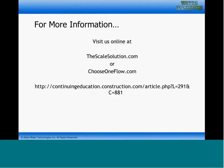So what we do in those applications where you have fresh copper on the feed side, we recommend putting the one flow tanks into bypass and allowing the copper to passivate. Through normal usage over the course of a month or so, that copper level will flush through. As a result, you can safely put the one flow tanks or cartridges into service after that copper has oxidized, passivated, pickled, whatever you want to call what's taking place. But again, the fresh copper will be susceptible to one flow. The one flow will suck it up, and it could compromise the surface of the media. So again, a very good question there.